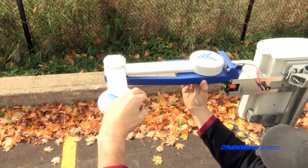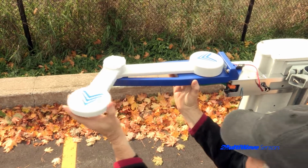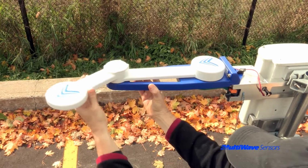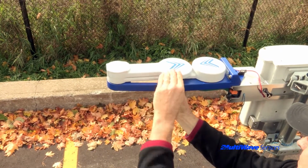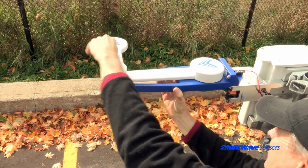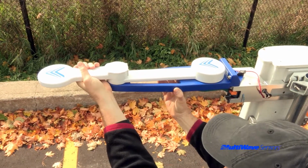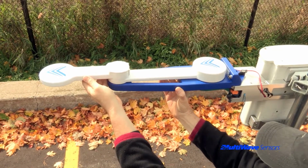The front arm is stuck and will not retract to the storage position. If you rotated the front arm to the forward position in a clockwise direction, you need to return it using the same path, counterclockwise, because the short arm cannot rotate in a complete circle, 180 degrees each way.